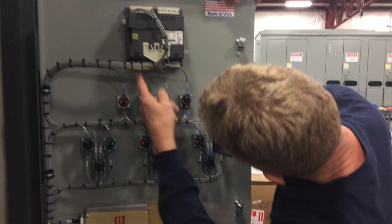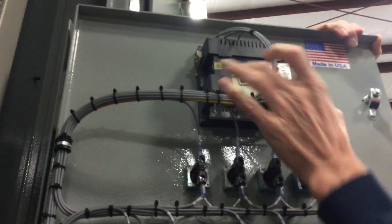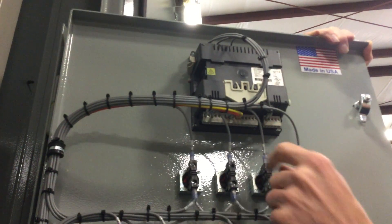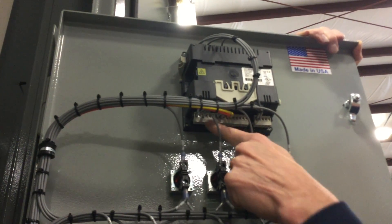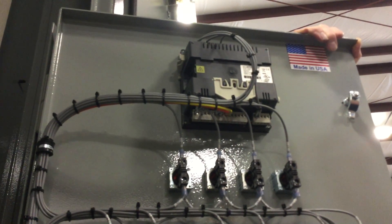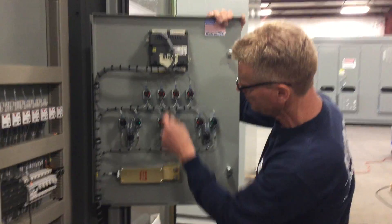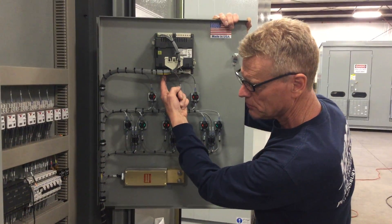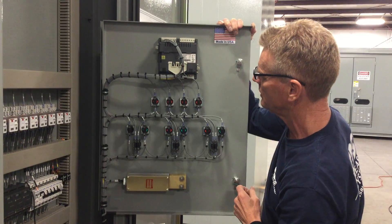There's also a voltage input, and the meter needs both voltage and current in order to work. The voltage may come from a VT that's installed in the bank and is operational when the medium voltage is connected, or it could be a separate source of VT coming from elsewhere on the network.